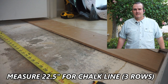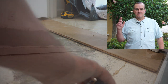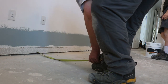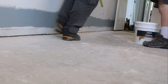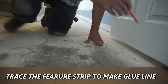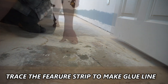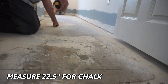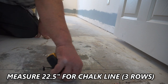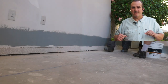It's time to lay this floor out properly, and the way to do that is with chalk lines. Let's listen in on the job as my sons and I set this floor up. We have to lift that board up — the board is 22 inches. We're going to do the feature strip and then we're going to lock it in. Three rows start, so we're ready to spread that glue.